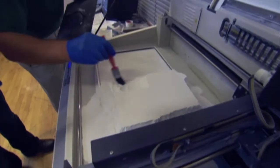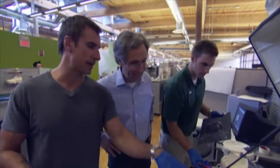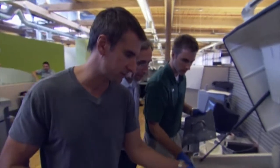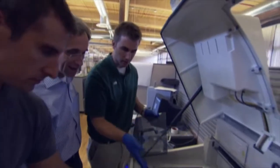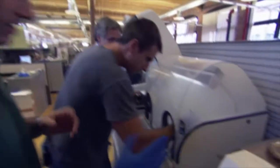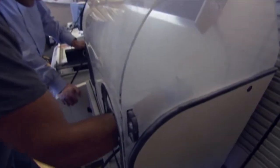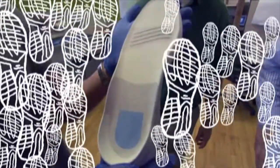In there is the 3D representation of what we designed on the computer. It's a plaster material — it just lays down a binder. So it's like putting water in kitty litter and it just hardens in thin layers. Once the sole hardens, we'll dust off the excess powder. And a sole is born. This prototype will be used to make thousands more.